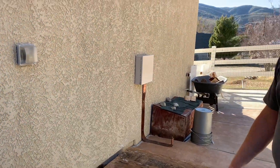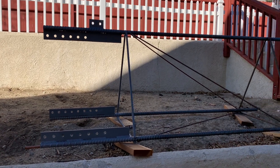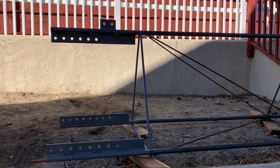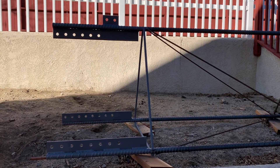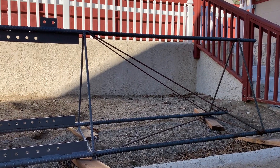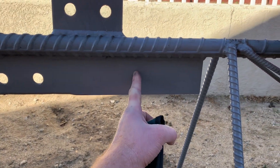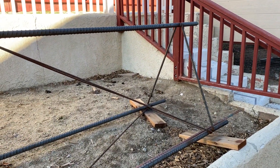Here's the base for the tower, which is also the concrete reinforcement. The tower's outside legs are 28 inches; this cage is 38 inches outside, with number 11 rebar, number 5 crossbars. Six and a half feet of this will be buried below grade — right about there.